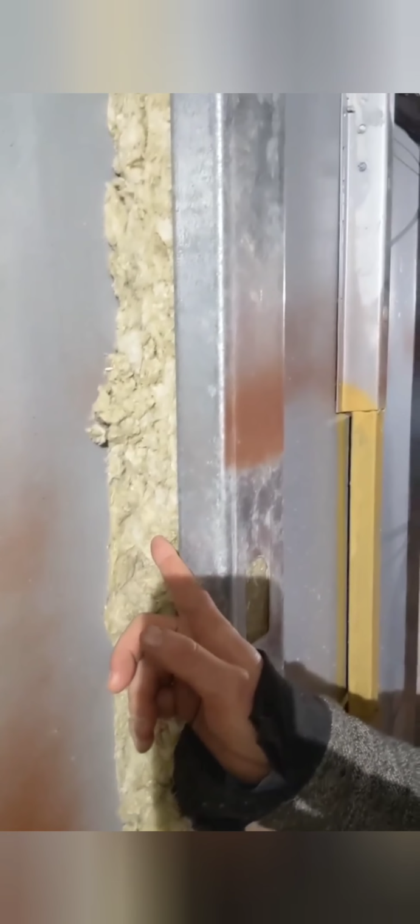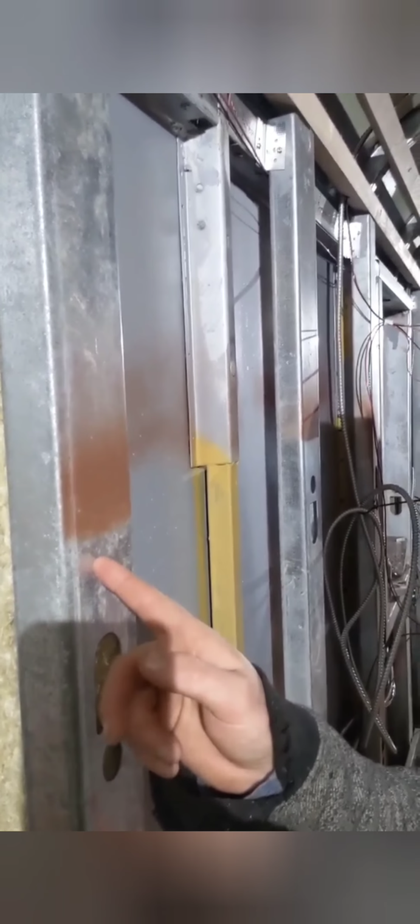We're going with Rockwool, and I got 3.5 inches here. What I'm doing right now, I'm just cutting some pieces. They're just big enough to go to the wall and inside these. That seems to be working. It's coming along, guys. Getting all of that insulation in.